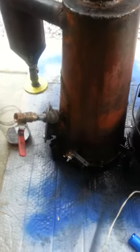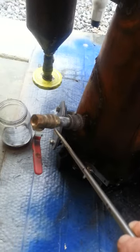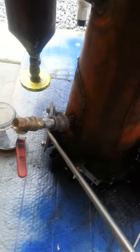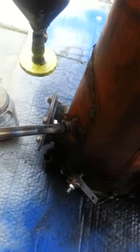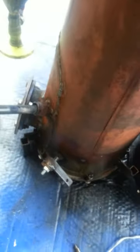This is tape two covering my modifications to this gasifier. I added a cleanout so I can inspect the ashes and see the results. I also added a lid to seal off the top. On my lighter tube I added an extension to take it down to the ash bin at the bottom, to put the burn down there — which seems to work really well and turns it into ash.